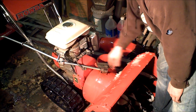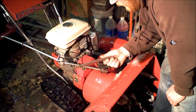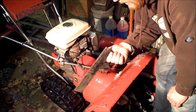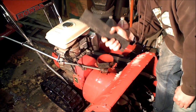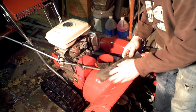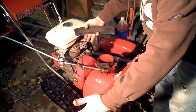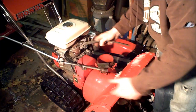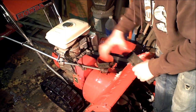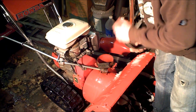These two pieces came off of other snowblowers — this is all you need. We're just going to screw this to the blade. If you don't have old rubber paddles lying around, other things you can use: I used to use mud flaps. I went to a trailer supply store or truck store and bought one huge mud flap for about five bucks. I've cut that thing up for a million uses through the years. Or if you have an old tire, cut out a piece of the sidewall and you can use that in here as well.